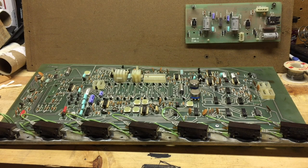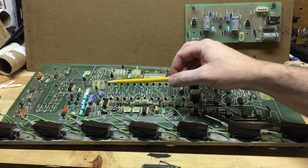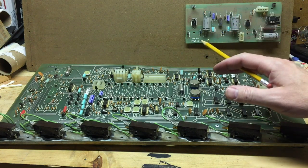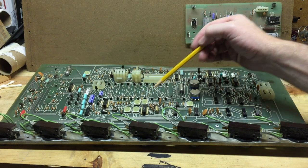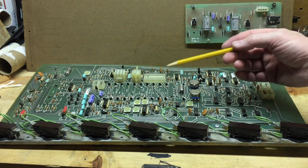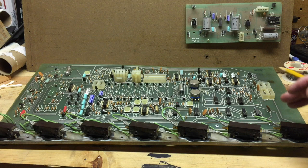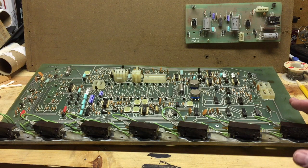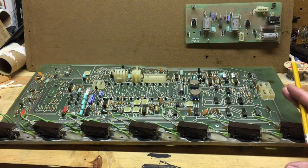Welcome back! This is video three of three of the Moog Taurus refurbishment project. If you've made it this far, my hats off to you. I've really had a fun time working on this thing. I hope you've enjoyed watching it. In this last video we're going to be replacing the electrolytic capacitors in the power supply circuit board and a couple in the main circuit board. As recommended by Moog in a maintenance release they gave out in the late 70s, we are going to be replacing these potentiometers with ceramic metallic potentiometers. Those do better in a high heat situation and don't drift as much, which gives better pitch stability. After we're done with that we're going to be putting it back together and finishing it all up. So let's get right to it!